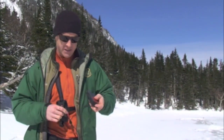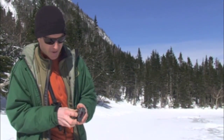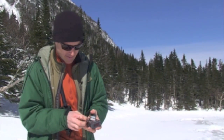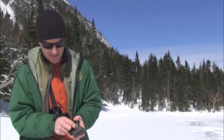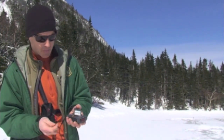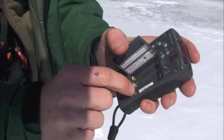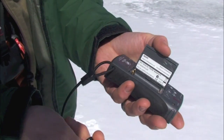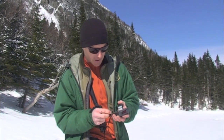You want to make sure all the buckles are actually working and present where they should be, and that the harness fits you the way it's supposed to. In addition, open up the battery compartment. If it were last season and you're starting out the season this way, you'll want to add your batteries. But before you put them in, take a look at the contacts and see if there's any kind of corrosion whatsoever in there. There are some things you can do to clean it off, but if you have bad corrosion, your batteries might not actually work.